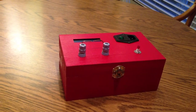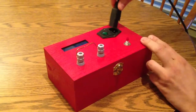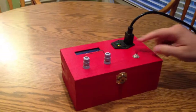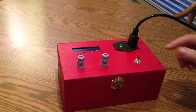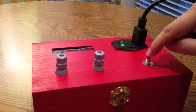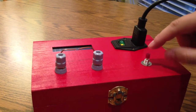Let's see if that actually happens. I'll plug this thing in here — so I've got my 120 volts coming in, it's always nice to see the light come on. I'll turn this on here, which puts power into my switch, but the switch is open right now so it's not on. If I push this switch down, I'm energizing the primary coil, and then when I release it — I see the spark. And I'll do that again for you.